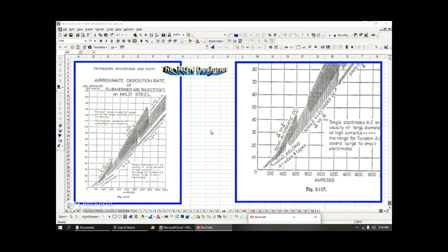So in this slide, again, remember, I'm trying to explain to you how welds fail, okay? And as a welding engineer, the best thing to do is to remember rules of thumb. Just like we said that the throat is 70% of the leg, and for every 3/16 weld on a 1/4 inch plate, it can hold 1,800 pounds single-sided weld in bending moment and shear. And if you have combined loading, you divide the load among shear and among bending. Okay, so here we go again.